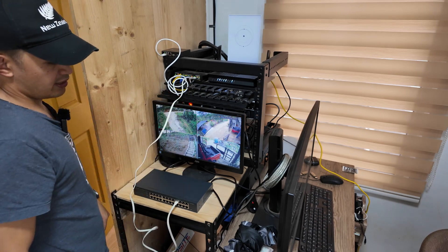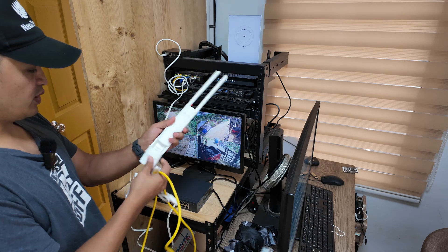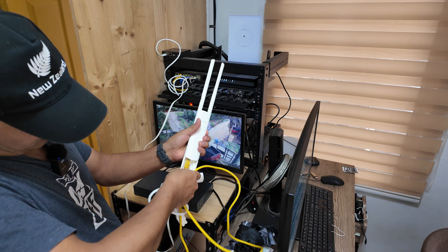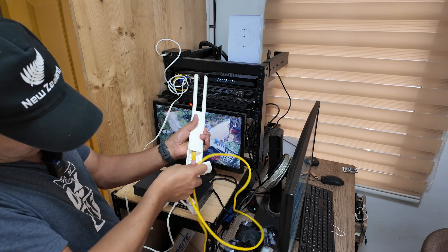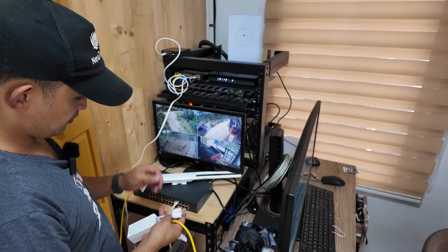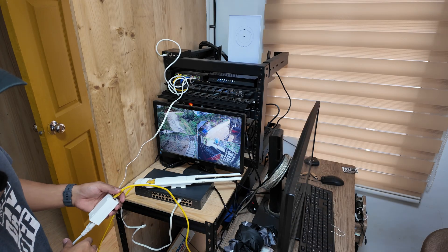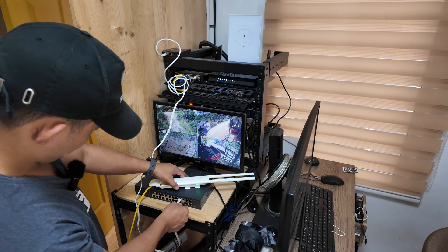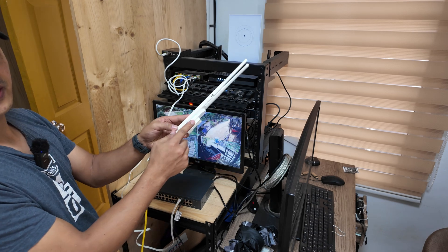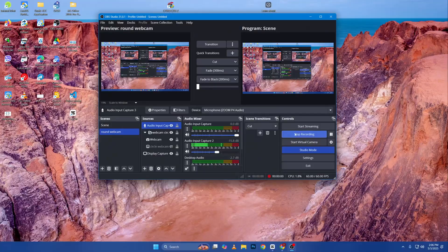It's lighting up. I'm going to plug these access points — open this one, plug it to the switch. It's PoE, so we need cables for each one. This is already powered, and I'm going to access this one now.